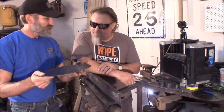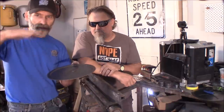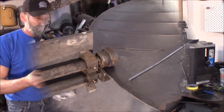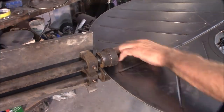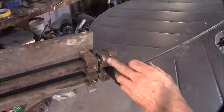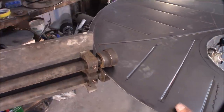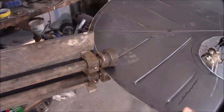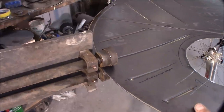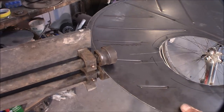About an eighth inch - yeah, an eighth inch - because I got plenty of room between the gas tank and the plate. Now we're getting the larger piece rolled. You can see Rick is checking the dies and the piece of metal. We had a little problem on the first one we did where we broke through, so he's just making sure the pressure isn't too tight on the bead roller.